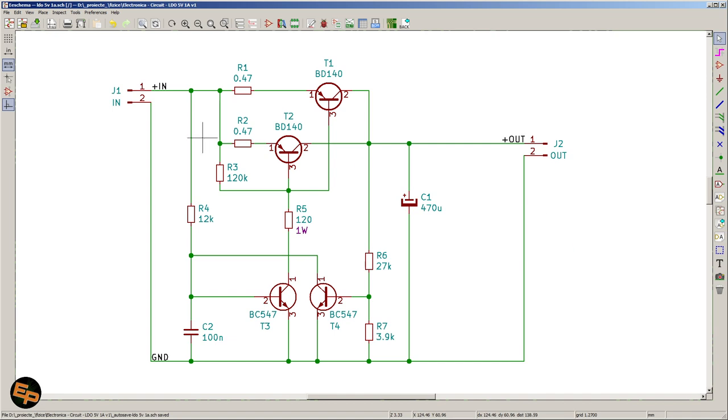This is pretty much my circuit — it's pretty simple. As you can see, it doesn't require any Zener diode or other form of voltage reference, integrated circuit, or anything like that. It just relies on the fact that the control voltage — the base-emitter of T4 — is a fraction of the actual output voltage. From actual measurements, I've seen exactly 600 millivolts across R7 and the base-emitter of T4, so you can easily calculate based on the resistances and 600 millivolts what the output voltage is going to be.